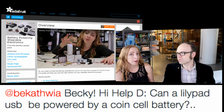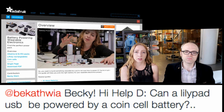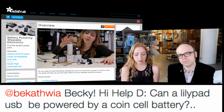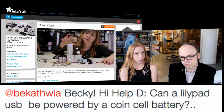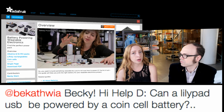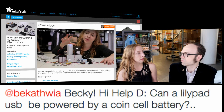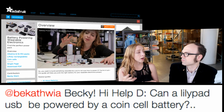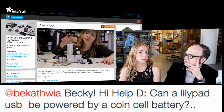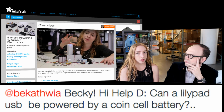Instead of just saying yes or no, I want to teach you how to fish and show you that there is a tutorial and a video on the Adafruit Learning System about battery powering your wearable electronics. It teaches you how to use the formula for adding up all of your components' amperage draws and comparing that to the total capacity of the battery you want to use. That way you can do the math for how long each battery pack is going to last, and then decide, because it's a trade-off: a really small battery that lasts a shorter time or a much larger battery that lasts a very long time. There's a time and space trade-off there, but you can calculate it out.